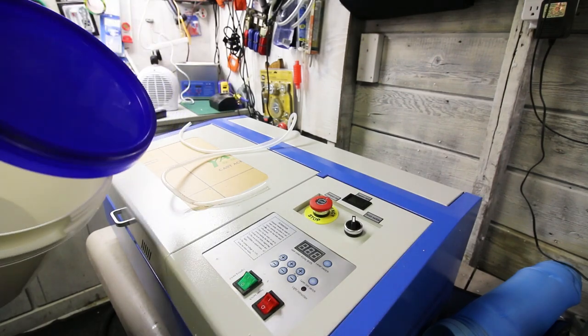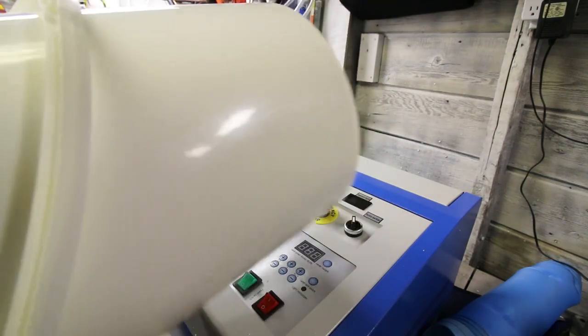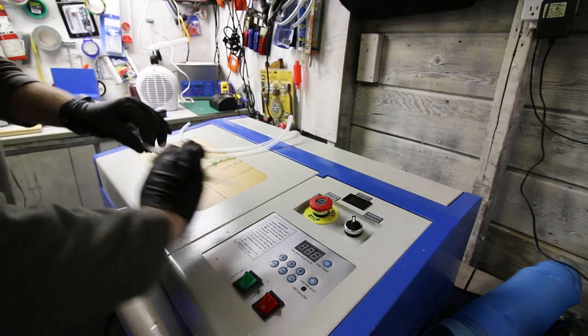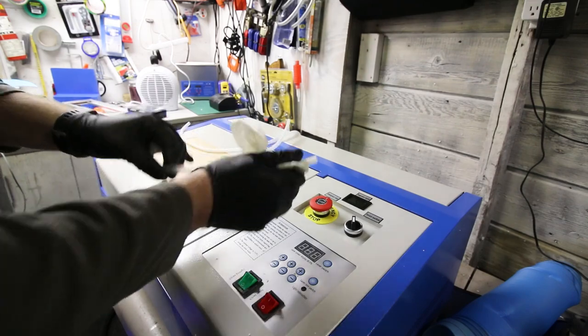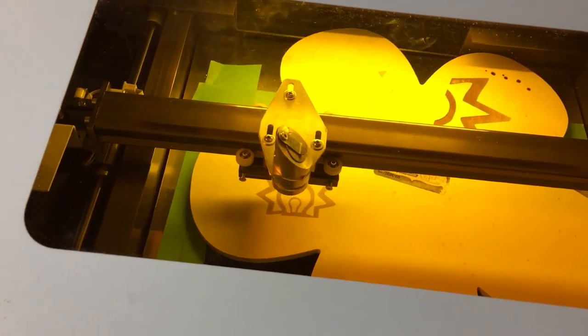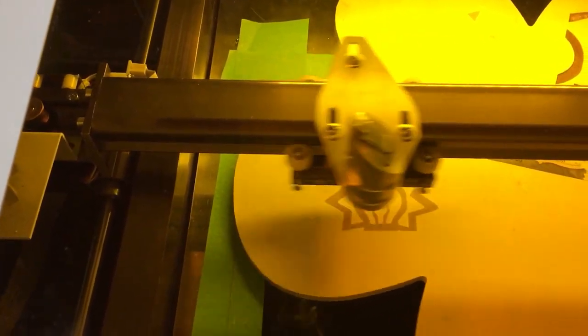For my setup I used a five-gallon bucket for my sump to hold my coolant. I used automotive antifreeze coolant because it gets very cold here, and if it freezes and splits that laser tube, well you're out of luck. I was actually up and engraving and cutting in about maybe an hour's worth of work with mine, including the initial modifications — so pretty happy.